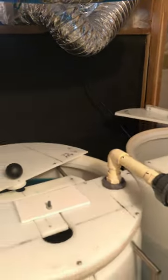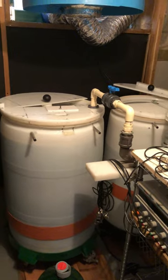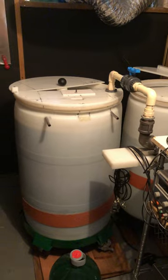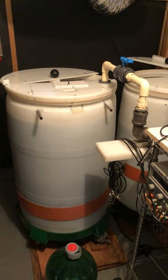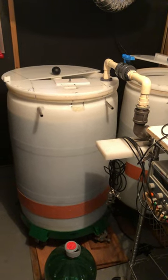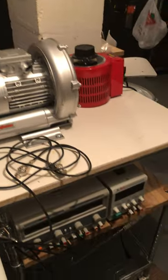To make this, I use a series of skills. The first of many is electroforming, or electrotyping. This is a 55-gallon drum. It is filled with distilled water, copper sulfate, sulfuric acid, hydrochloric acid, and a few additives. In later videos, I'll explain more about how these tanks work and what all these parts here are for.